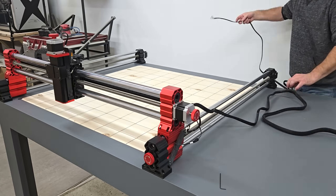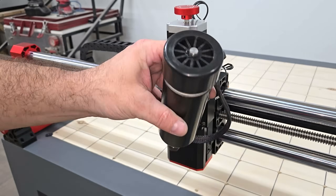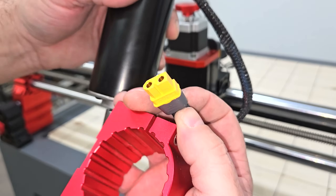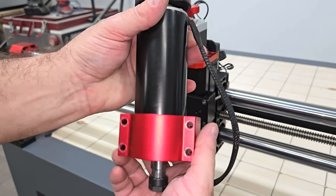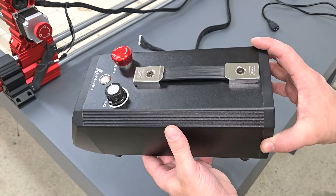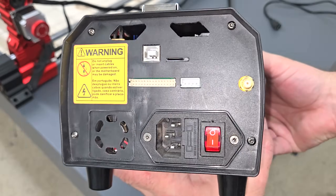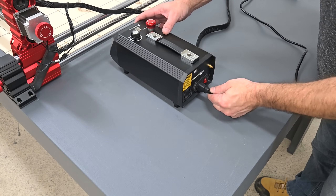An even larger version will be available with a work area of 2000 by 1000 by 100mm. The machine comes with your choice of a 500W spindle, an 800W trim router, or a 20W diode laser module. The motion controller has a touchscreen display, SD card slot, Wi-Fi and USB ports, an emergency stop switch, a key switch, and spindle speed control. Eye and ear protection were included, along with all tools and fasteners. Two Trees designed it to be quick to assemble and disassemble for storage, though at 40–80kg depending on version, a sturdy table is needed. I had a dedicated table built with a removable spoil board and T-nuts for clamping before delivery.